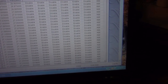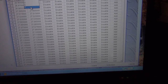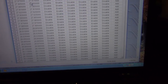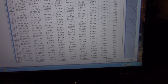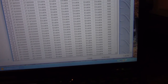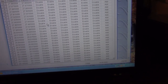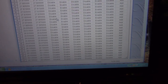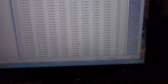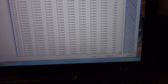If we go to Foxtrot — what I did was I downloaded and read the data that was on the radio. I'm going to reprogram it. I'm going to program some 10-meter frequencies into it, including FM simplex, and maybe repeater frequencies. I'll probably program some repeater frequencies in it, although it doesn't have a CTCSS tone board in it. But I think I've got one around here somewhere that I can add to it, or I'll buy one off eBay. They are available — not for this specific radio, but universal ones.